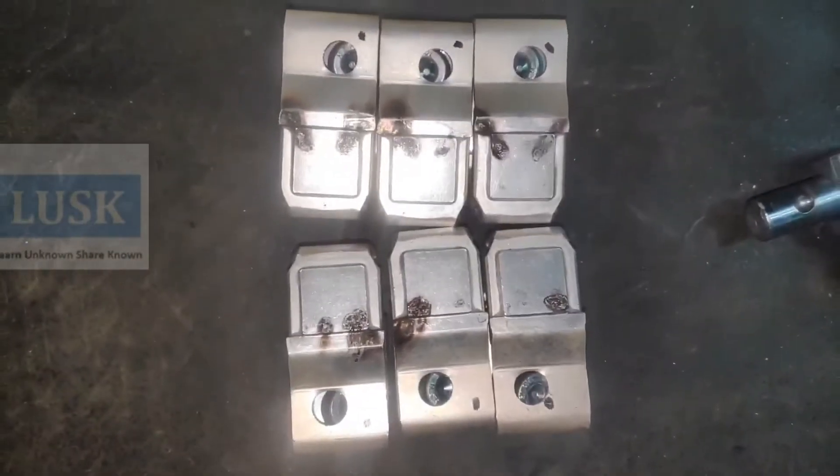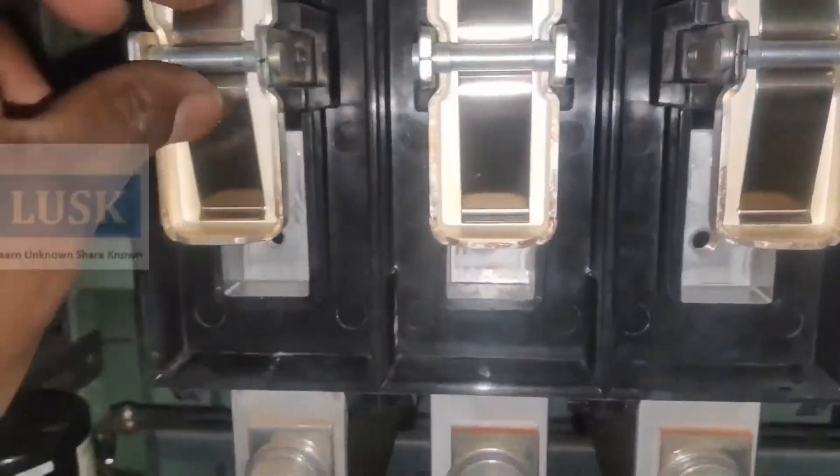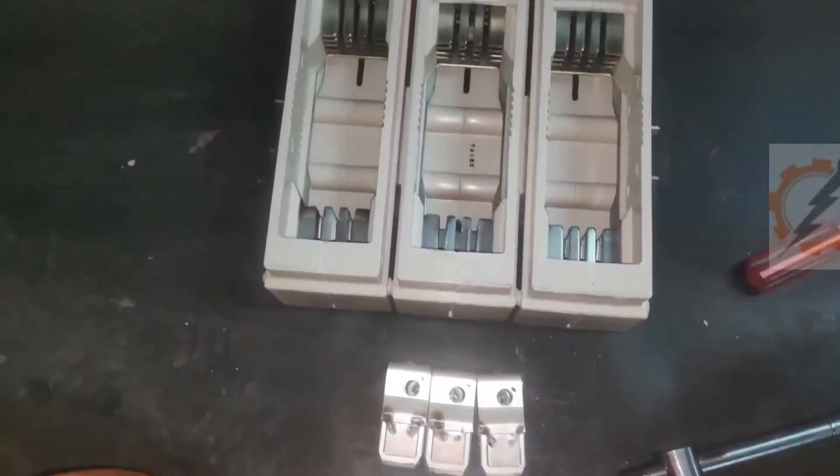You can see the markings of the burned areas. One by one I will use a soft emery paper with electric contact cleaner and clean each and every contactor the same way. After cleaning, we box it back — it is very simple and easy, no need to be nervous. Just isolate the power supply, and make sure no one is going to switch it on. Please do proper lockout and tagout so none of them will switch it on.